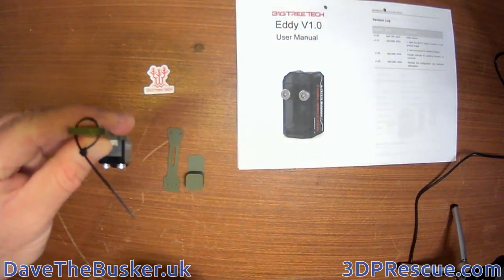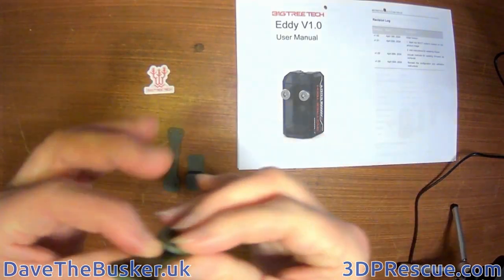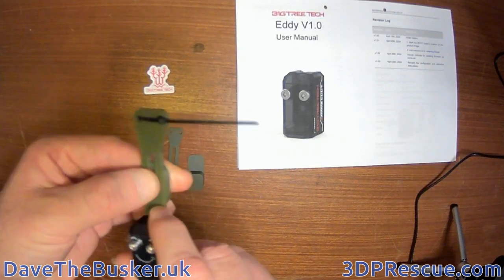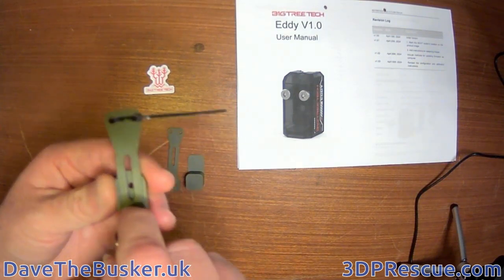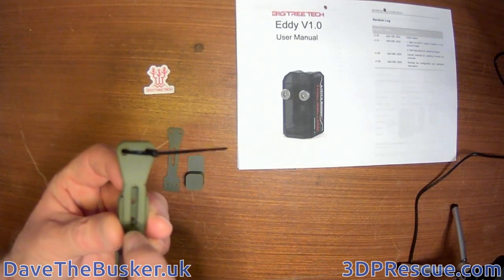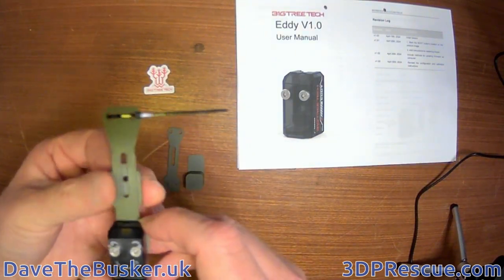There's a spacer because if you just put this straight on the carriage plate, as it goes to X max it collides with the bolts on the belt adjuster. This just offsets it a little bit. Also, because it's got two holes and these side rails, it helps stop the mount from being able to pivot where the slot is slightly slack. All you do is use a pair of 10mm M3 bolts - I use button heads, just don't use countersunk because they push the slot open.